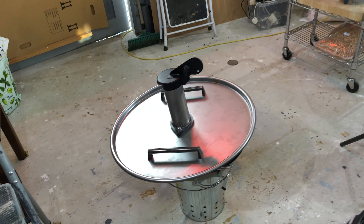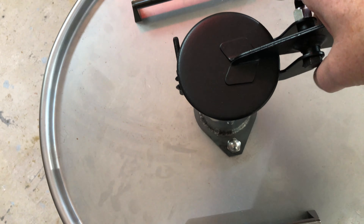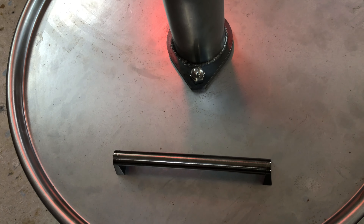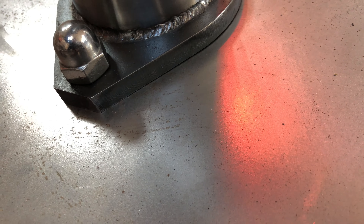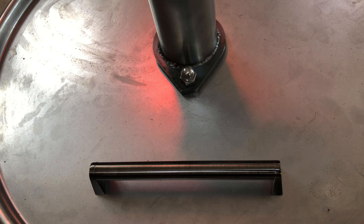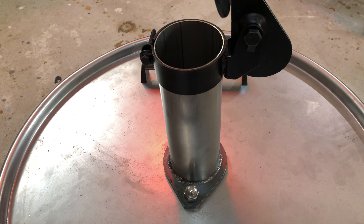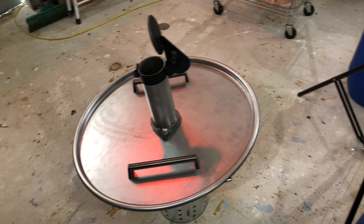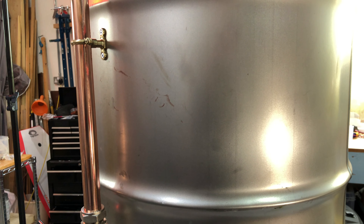Since the last update I've been drilling and polishing as you can probably see. I did end up using the curtain rod end fitting — interestingly it's soldered straight into the copper pipe with lead-free solder, the same stuff you use for household plumbing. It soldered perfectly. There's the Munson fitting, polished copper pipe, ball valve, elbow, and that tank fitting — I turned it around the other way. I didn't need to use the compression side at all which made it so much easier, I just soldered it in. So there's another tip. There's one on each side of the drum.